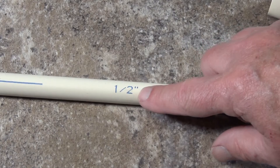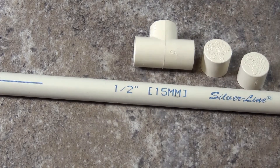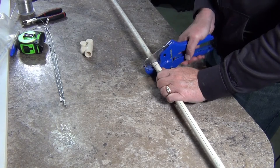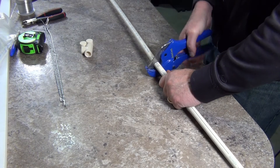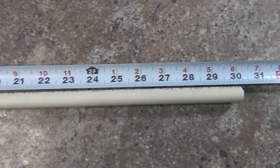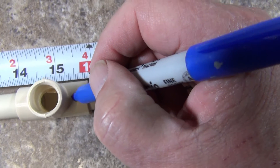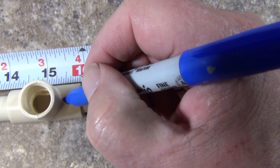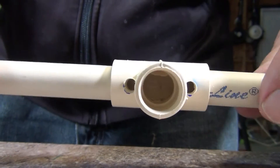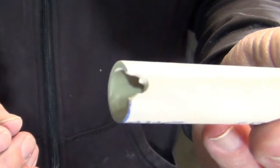Next, I will fabricate the antenna shell. One half inch PVC and a T-fitting will work perfectly. I'll use end caps to seal and finish it off. I measure 14 and 3 quarters inches on the PVC pipe and need to cut 2 of these lengths. Once the T-fitting is installed, the total antenna length is 30 inches. Now I have to drill 2 holes through the bottom of the T-fitting and through the PVC lengths, then use diagonal cutters to trim the holes into slots.